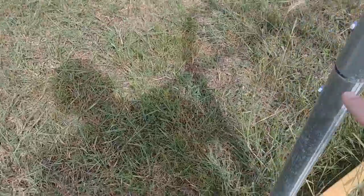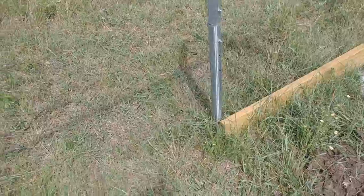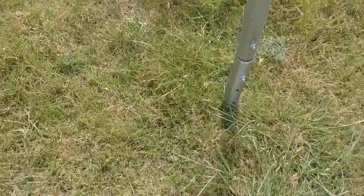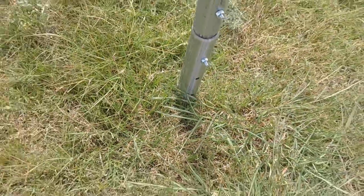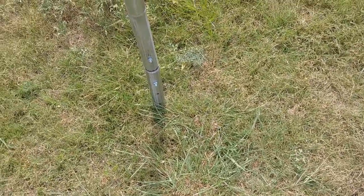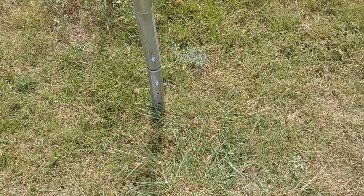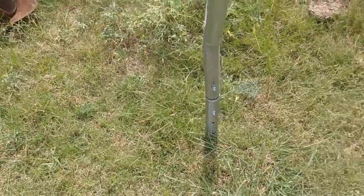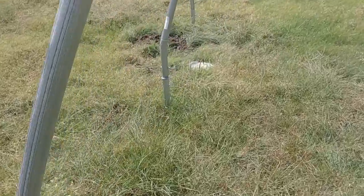The manufacturer just has you drive these base posts into the ground to grade — I'll show you on this other side. They have you drive it into grade, and there are two holes where your baseboards go. If you buy their tie-down kit, you could pour curbs for this, or pour a two-foot slab that goes all the way around similar to a curb.